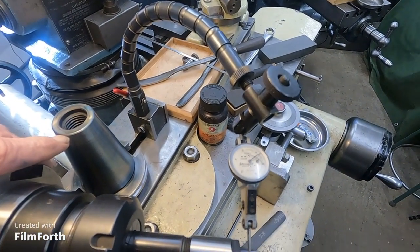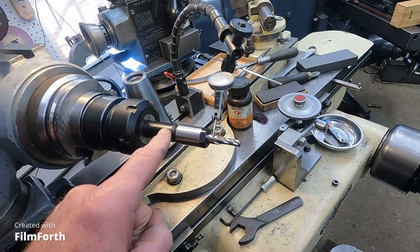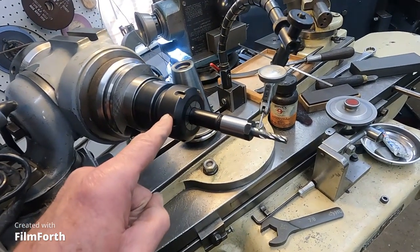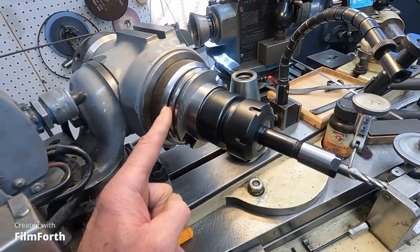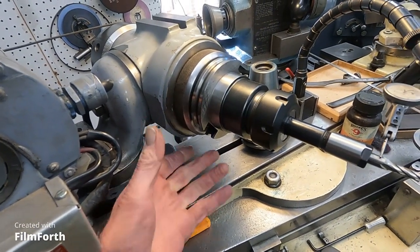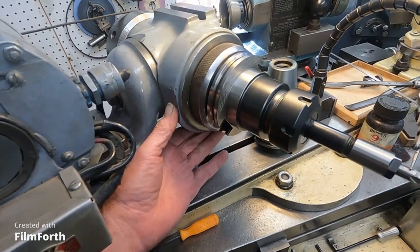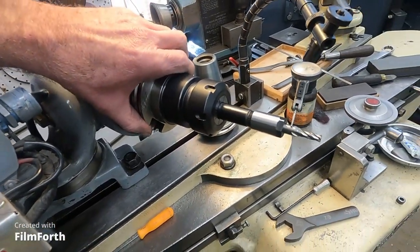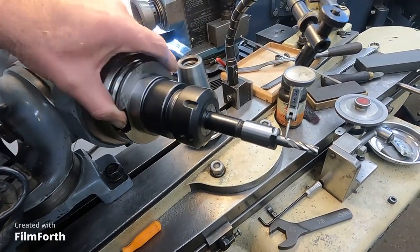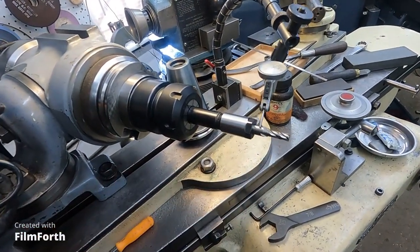I'm going to say 2/10 of 1/1000th run out on a 3/8 end mill in an Erickson extension collet chuck that's in an ER40 collet chuck that's inserted into this precision spindle of the Cincinnati workhead, which has a pair of Timken type 0 bearings in it. And this is about as precision as you can get right here. And that is extremely satisfactory. Could actually grind with that end mill 8 inches out. 80-year-old machine. How about that, huh?